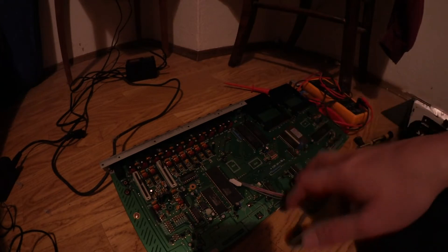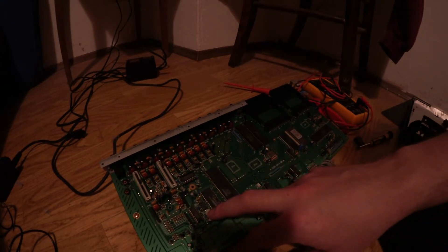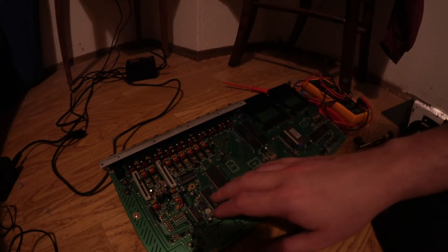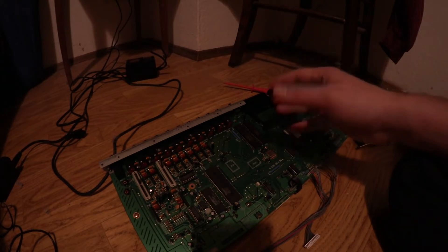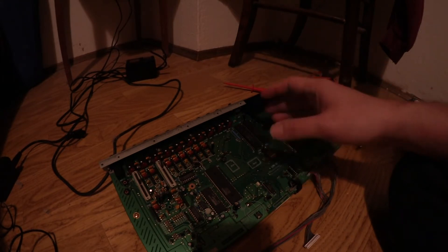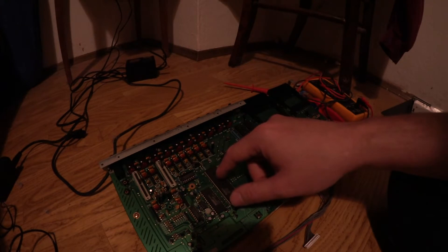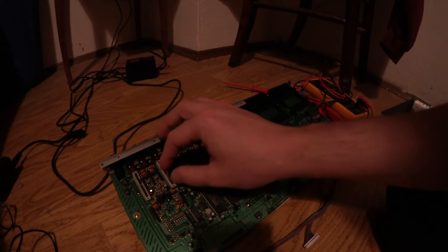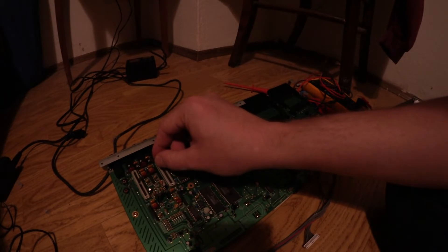I removed the board completely and it seems to be fine. The capacitors look fine, the caps on the board, and nothing really gets very warm when connected — except the power regulator, but that seems normal. I ran it for five or six minutes and it's okay, around 60 degrees Celsius. Since I have the unit open, I'll give a little deoxidization to the faders because they usually start crackling and making funny noises, and we don't want that.